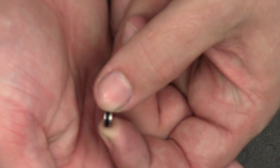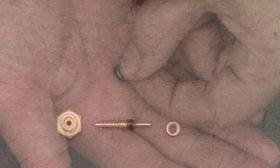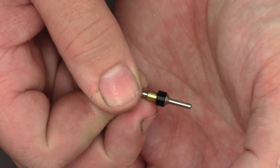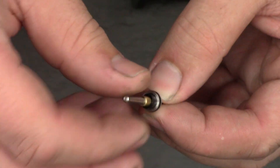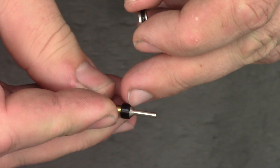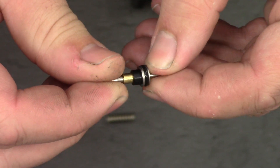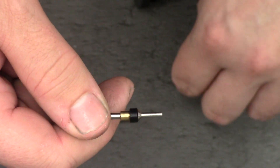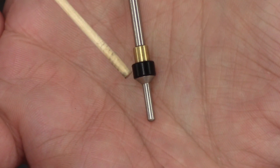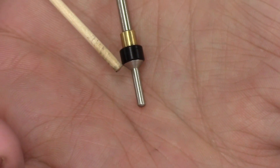And thirdly, there's the one around the valve seat here, and this one just stops air from escaping around the outside of the valve seat. The second thing that can be causing a leak is this valve here. The face of this little Delrin part presses up against the seat — if this face is damaged in any way or has any scratches or debris in it, then it's not going to seal properly, causing your bottle to leak when it's not connected to a rifle. So make sure there's no damage to this face, and if there is, buy a new valve pin. This very edge here is the part that seals on the valve seat.